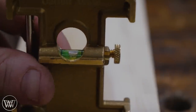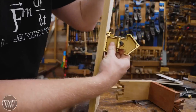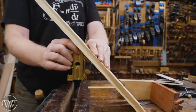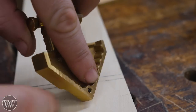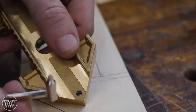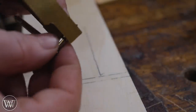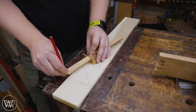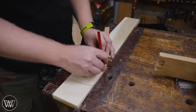It can be a mortise gauge or a depth gauge. Inside it has a fluid bubble, so I can use it as a spirit level. Or I could also use it as a plumb level. And along those same lines, I can also use it as a miter level. In the corner here there's a small point — a dimple hidden inside — and with this screw I can use the adjustment nut on the back and advance that point out so that it's now sticking out. With the point sticking out, I can turn it into a compass and draw arcs to match whatever length I need.